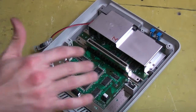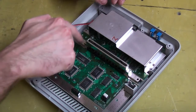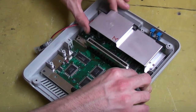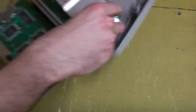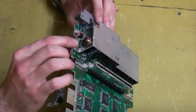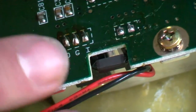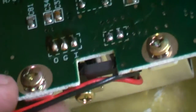That way you can lift the shielding out. And because we're going to be soldering to the bottom of the board, just use your Phillips screwdriver and start around and remove the screws so we can lift our main board out. Now we're going to start by soldering into our voltage regulator. Looking at the bottom of our motherboard, we've got our voltage regulator just around here.